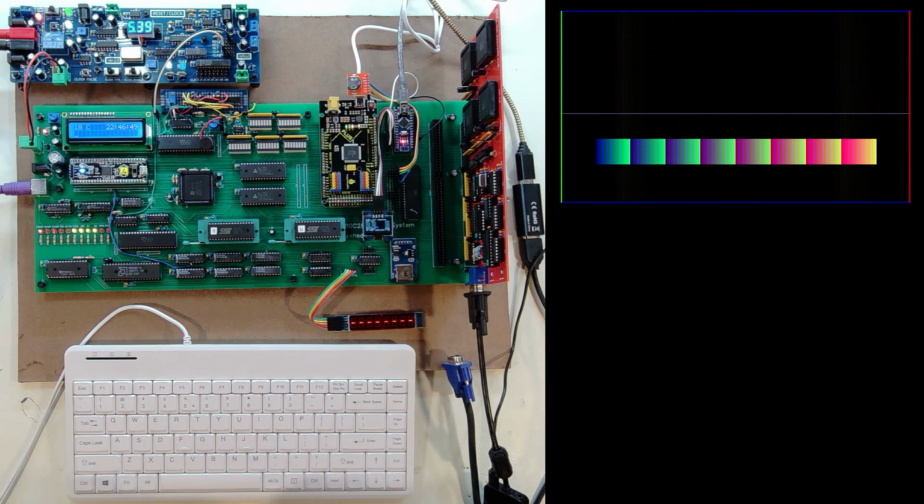And if I look at the output on the screen, you can see what I have there. I am showing across the very top and very bottom edges a blue bar. On the left edge, one pixel in, I skipped the far left pixel because I often pick up noise on that very first pixel, so I'm skipping it. Then I've got a green vertical bar, and on the far right, I've got a red vertical bar.